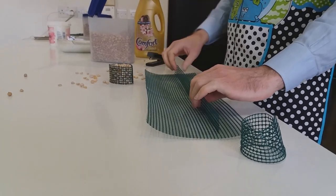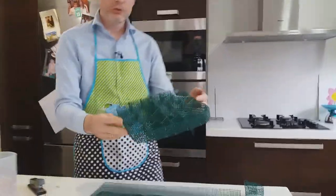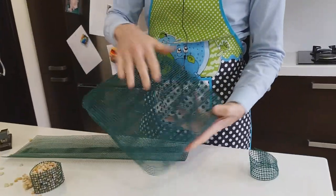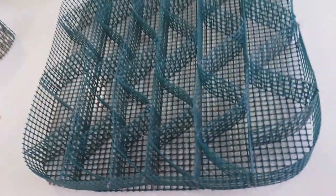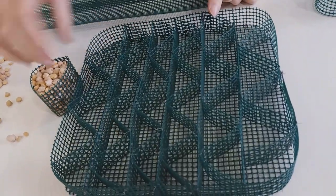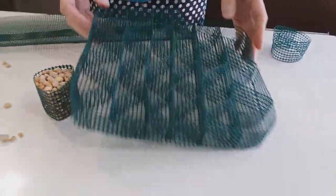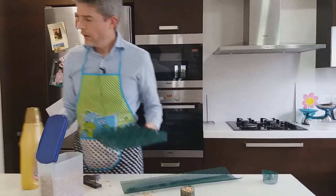Then we use the uniaxial geogrid and lay it vertically in parallel lines, and in between them we lay a zigzag pattern of geogrid. Because we've been at home due to lockdown I had a lot of spare time, so I actually made my very own model Stratum. On the base that's the geogrid laid down, these are the long pieces of grid that go across, and we have the zigzag pieces — and you can see we have lots of these cells of the same shape. If we filled that with aggregate, imagine what the performance of that would be.